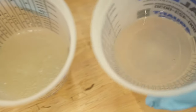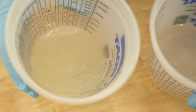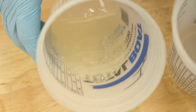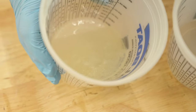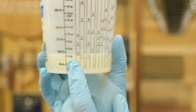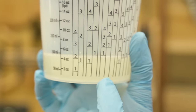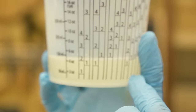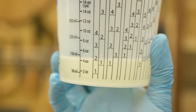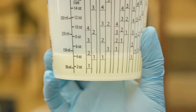I mixed up the thick set first — you can see how clear it already is, no bubbles left. Here's the 2:1 high performance I just finished mixing — look how many bubbles are still in it, struggling to release on their own. We're going to throw this in the vacuum chamber. With four ounces mixed, watch the edges — you can see bubbles slowly making their way to the surface. For a thin eighth-inch to quarter-inch pour, a heat gun can get the bubbles out, but any deeper you'll probably want the vacuum chamber for clear results.